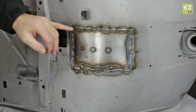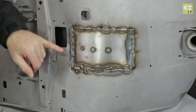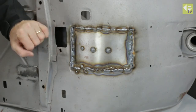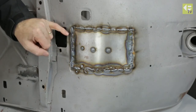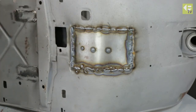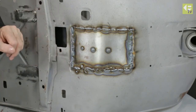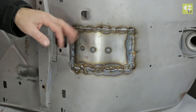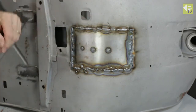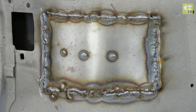Hopefully you can see the difference between the MIG weld, where you've got a lot more material added in, compared to the TIG weld which has much less material. With good joint fit-up you can get an absolutely flat surface with minimal refinishing. TIG welding is a slower process with less material build-up; MIG welding is much faster but you've got more finishing to do afterwards, and it is more tolerant to larger gaps in the material. Thanks for watching and remember to subscribe to our channel.